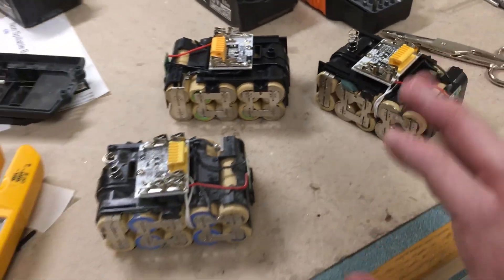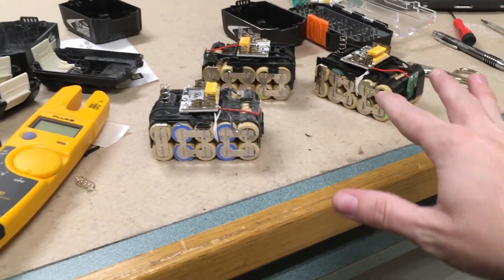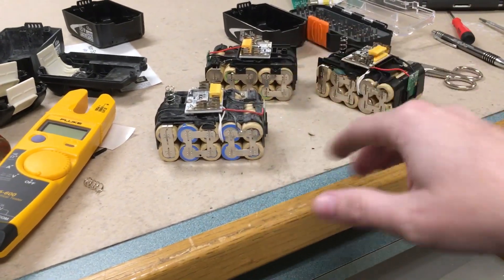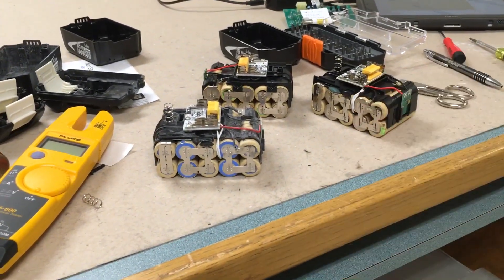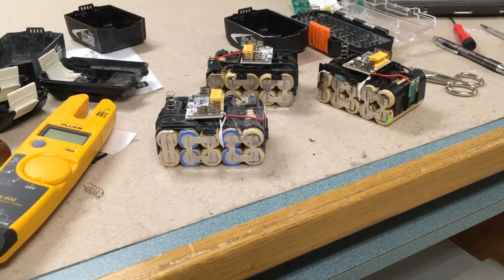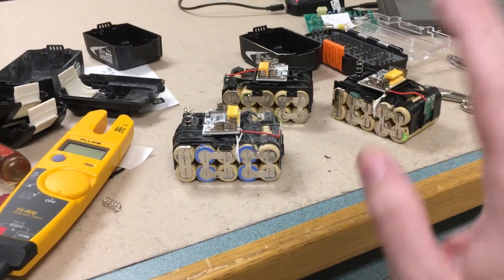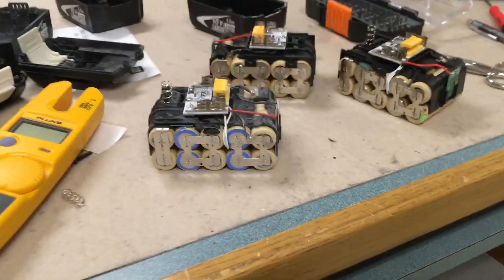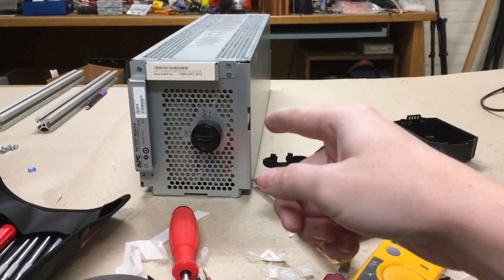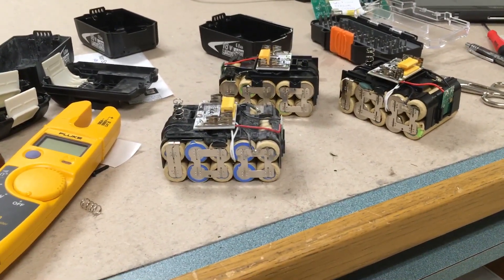This is a bit of a day ruiner, because you think about how these are not being regulated at all voltage-wise and they're just sitting here. We probably have a bunch more in this building and I didn't even know. We won't be getting these anymore unless we plan to add a proper BMS to them. I thought other packs were scary, but at least those actually make an effort to monitor the cells. Lithium-ion batteries without a BMS — that's terrifying.